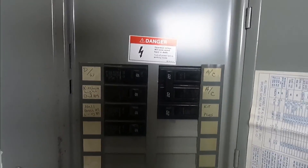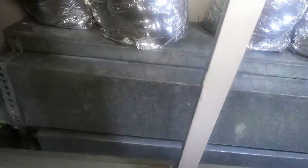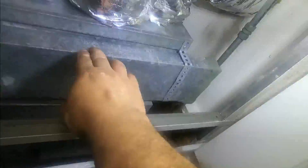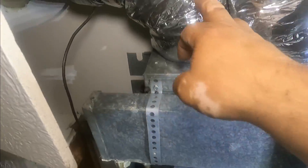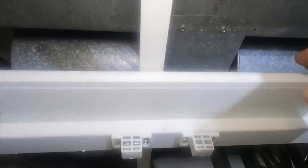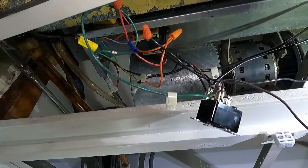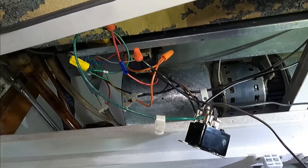Once I remove the ceiling tiles, this is what we see — this is the air handler. It is a pain in the ass to work on. This is my air handler, my condensate tray, and then the water goes into a drain right here. I have my supplies: bathroom, living room, kitchen, bedroom, and then my return is right here too in the same hallway. This is my fan motor — it has two cases, one to the right and one to the left. I have to remove these because the controls are here: the transformer and the fan switch. This is an old unit — there are no fuses, no control boards, no diagnostic lights to help you.